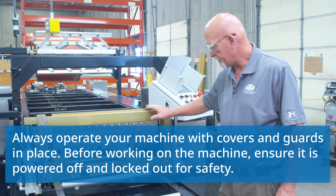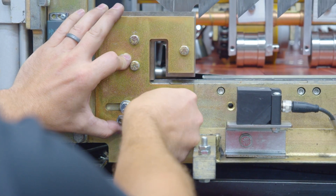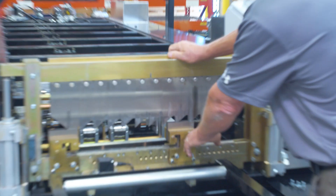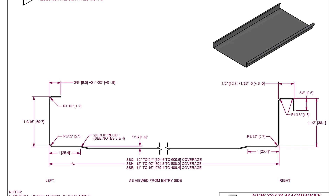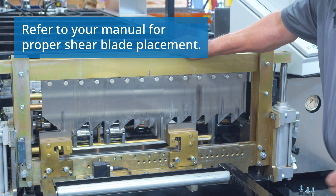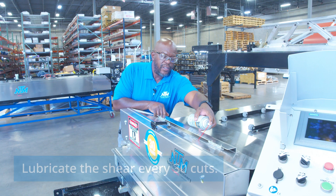To set the machine up after you've gone through and the panels come through and you've set your dies and everything's adjusted, then what you want to do is move up to the shear blade. I've got the back bolts loosened so I can adjust it side to side, and on this panel profile of course is the SS inch and a half. Your point of your blade you want just inside of this area here, maybe pointing at the bolt. After you get that set, you want to go ahead and lock down the back bolts, then you can go ahead and lube it.